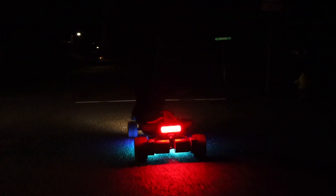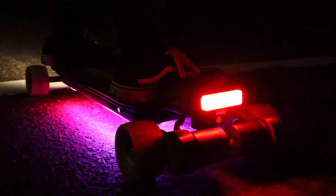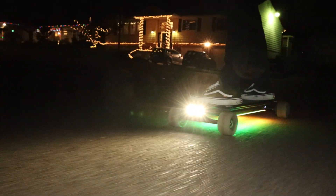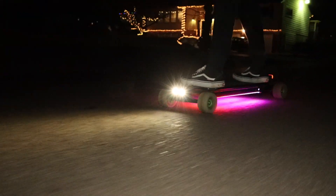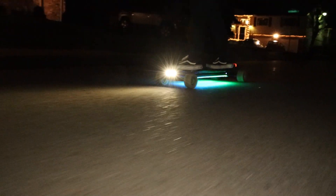The best option is to use a standard PPM remote with a momentary button, so you can perform all the RF remote functions directly from your controller. One feature I find super cool is the taillight — it gets brighter when you actually brake, because the TTL module receives data from your VESC. This mimics car taillights and alerts riders at night that you're stopping. The TTL system effectively combines safety lighting with LED expression for a complete lighting solution.